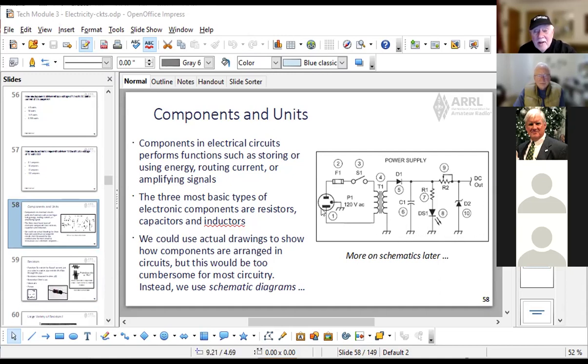For instance, this is a plug, and it's used for our voltage supply from the wall. You can see that there's a smaller terminal, a larger terminal, and that little plug. Each has its own purpose. The smaller one is the hot terminal. This is called neutral, and this is ground. Neutral and ground should be the same. If there's a voltage between them, we have a device called the ground fault interrupter, which you'll see in kitchens and bathrooms more than anywhere else, which will pop the circuit until something is corrected, because you can get a nice shock if these two are at different voltages.